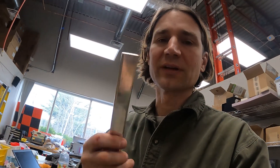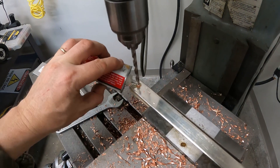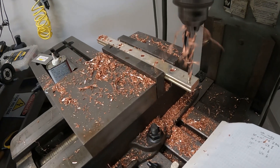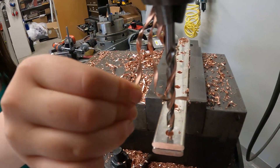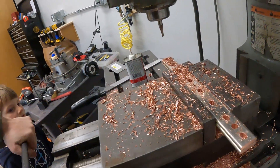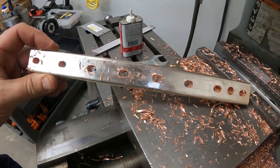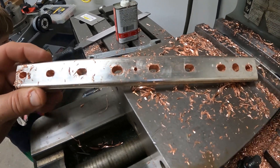I am so excited about finally getting to making bus bars. It just feels like an important stage in the project. So I have these heavy-duty copper, quarter-inch by one-inch tin-plated bus bars. Here we can see our heat slots, one big hole for a cable, and then we just still need to tap that in the middle and this will be all set to go.